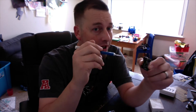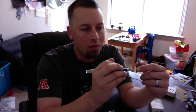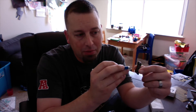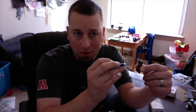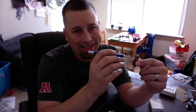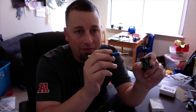On the voltage pad set, the five and the three represent the voltage that's going to come out when you connect to your RX pads. So if you need five volts for your RX, you bridge the middle pad and the five-volt pad with a little bit of solder. Put a little flux on there, then solder the two pads together, being careful not to touch the three-volt pad.